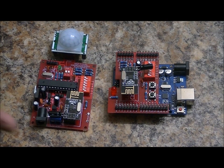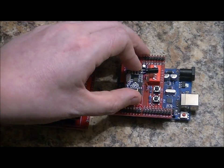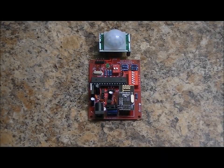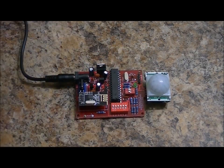Right now, when it's powered up it's going to calibrate itself. Once there's movement, it's going to send back data to the transceiver shield and we'll have the serial monitor up on the computer, which will tell us what room has movement in it. These generic PIR motion sensor modules take about a minute to fully stabilize, so I've programmed in a little blink setup just giving the sensor time to adjust. The green LED is just going to blink, and when it's done blinking, the calibration is done.